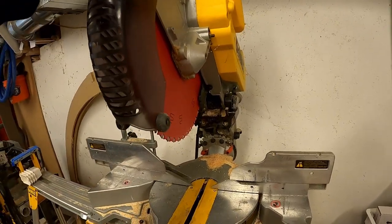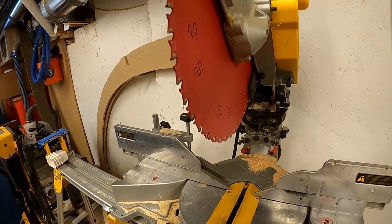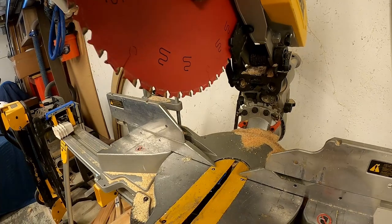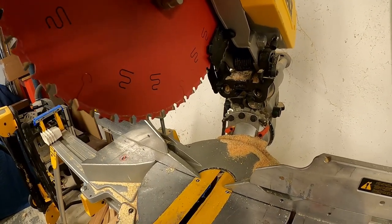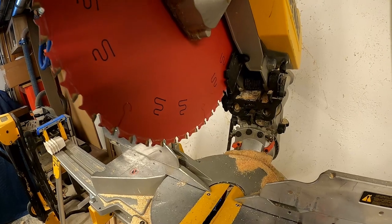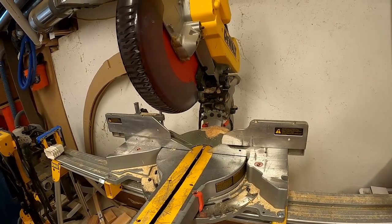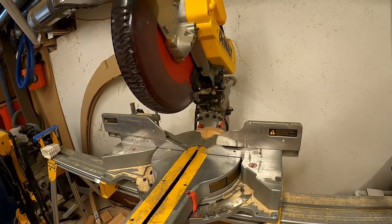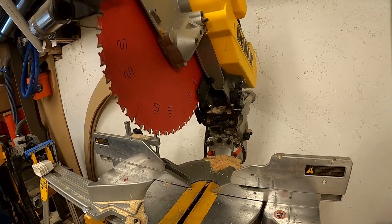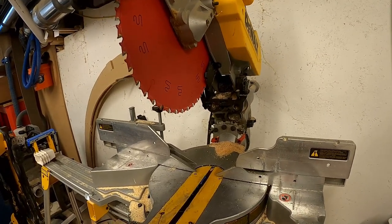So we're in the shop and I want to show you what blade not to use. This is just your typical DeWalt framing blade — cutting two-by-fours, rough cuts, no finish work. Don't cut track with this. It will crack the track even with the softest track from Track Daddy. The Kinetic Noise track, which is also a pretty soft track, will just go flying everywhere and crack out — it just won't give you a finished product that you like. I'll put the correct blade on after and you'll kind of be shocked — we actually use a fine-toothed aluminum blade, and it just cuts through the track like butter.